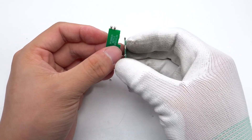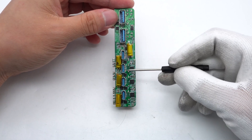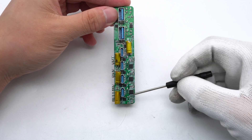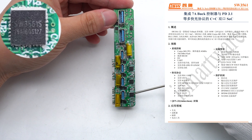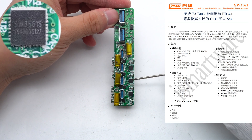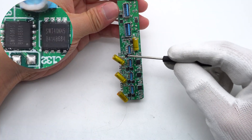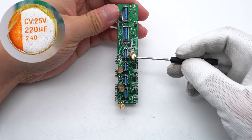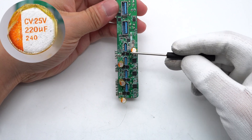The two PCBs supporting the output buck PCB are fixed by soldering. The front of the output buck PCB is equipped with USB ports, filter capacitors, synchronous buck MOSFETs, and buck protocol chips. All five buck protocol chips are from iSmartware in a QFN32 package, integrating a high-efficiency synchronous buck controller with complete protection functions. The MOSFETs marked SWT40 and SWT45 are from iSmartware. The solid capacitor for output filtering is from CanCap, rated 25V/220μF.